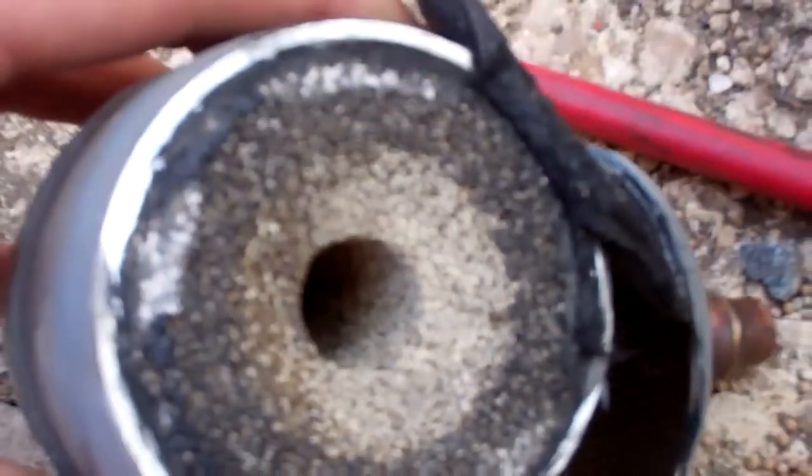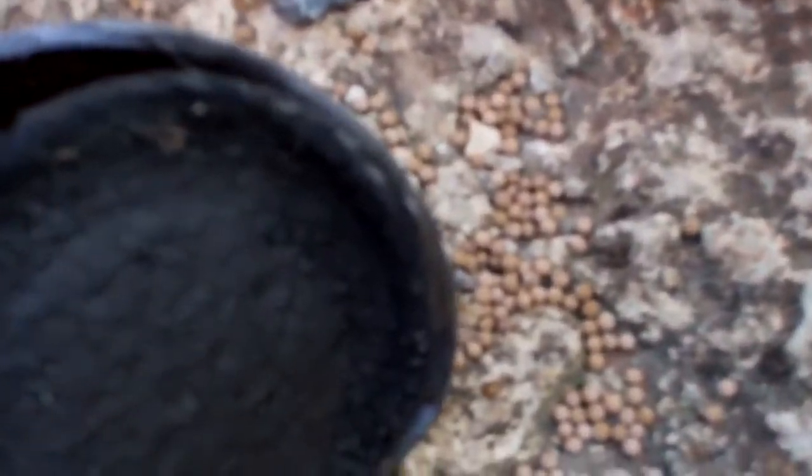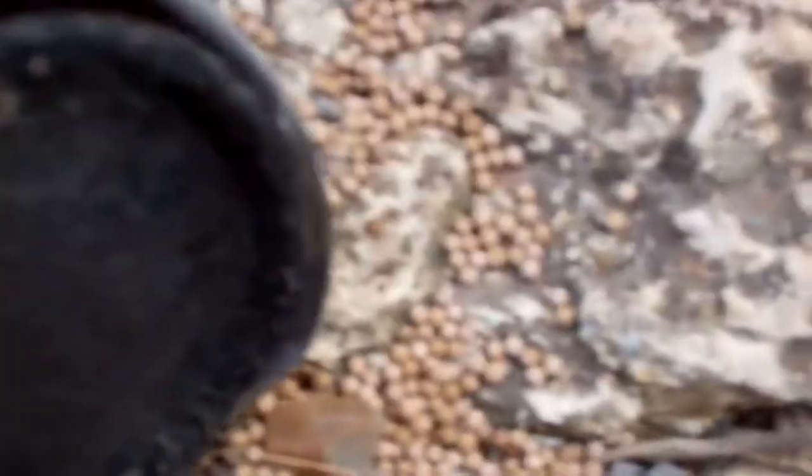This one's off of that big 6.5 horsepower compressor that I changed the other day - that wasn't pumping and didn't sound too happy. It's very oily and dirty looking. That felt pad - it's just like grease, like aluminium grease on there, which must come out of the rods as they've worn away. Again the other side's pretty bad, but it's done the same with the gauze - just pushed it in.